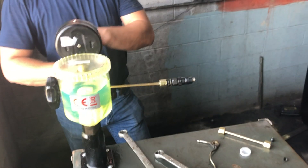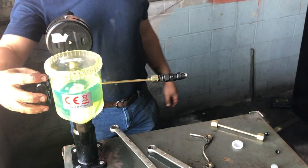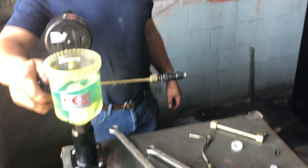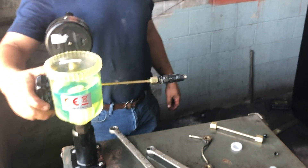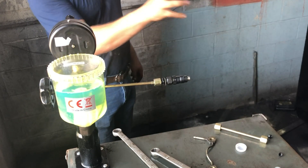Here's what you want to watch if you're actually watching this part and not fast forwarding: I leaned on this with both hands, and you'll notice when I go slow it has a very specific pop-off pressure — it was about a thousand psi give or take. A camera with slow motion would have been great to have on that gauge.